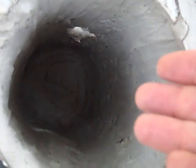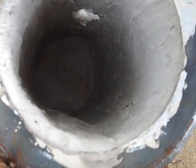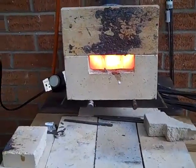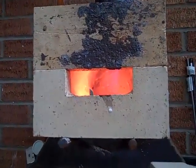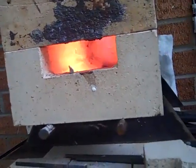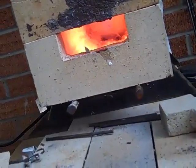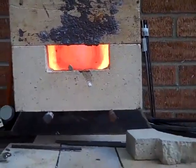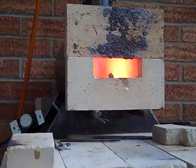What I have to do is let this air dry for a few hours, then I'll fire up the forge, let it cook for just a few seconds, shut everything off, let it cool back down, and repeat that process several times until this is hard and dry. I've done two heats for a short period of time and now I'm really baking on that first layer of Satanite. One thing I can tell already is that the ferocious hot spot I used to have is now much more diffuse — the scattering of the heat. So that's a good thing. I'm going to turn this off, let it cool all the way down, and then put on another coat and repeat the process.